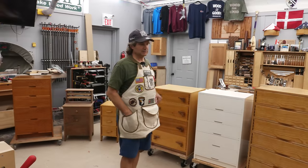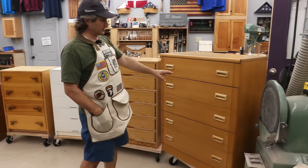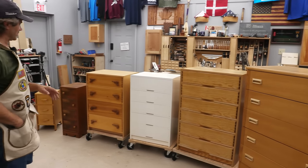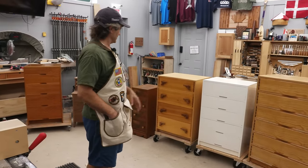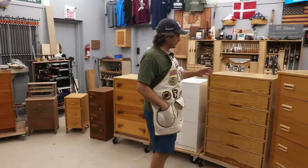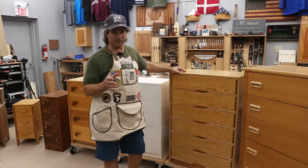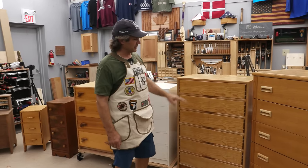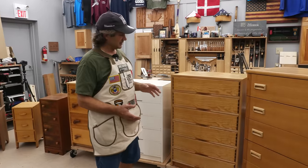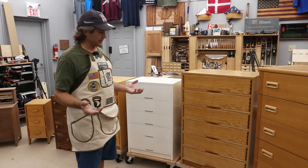Back to the bench. Here are some samples of chests of drawers that I've built. This first one is actually a manufactured piece — I'm going to use it as an example of what not to do. The rest are pieces I still have in my house, representing casework from 35 years ago up until fairly recently. I'm going to focus on the case because if it isn't square, it's very difficult to make a good drawer — meaning to get that perfect fit. The sides have to be parallel to one another, and the top and bottom must be parallel. It's just a box designed to fit other boxes.